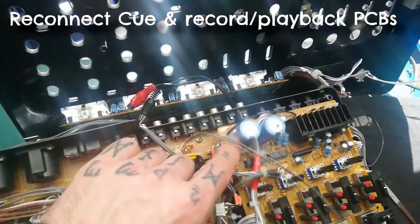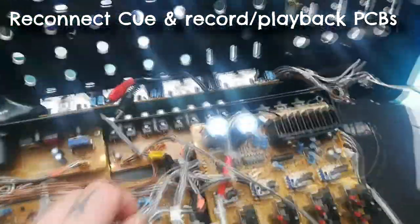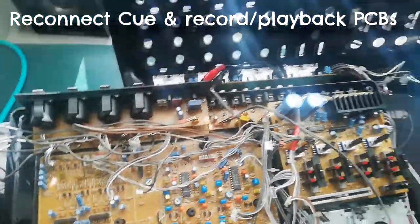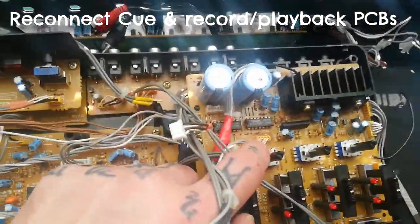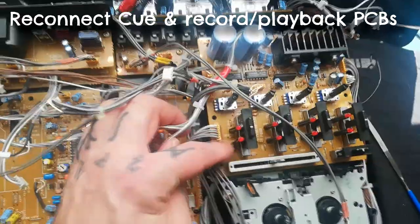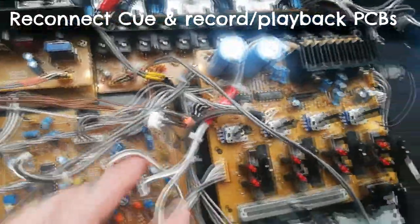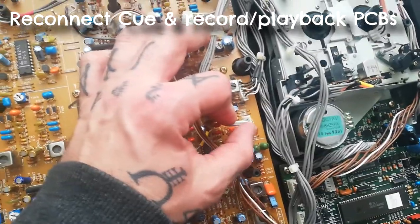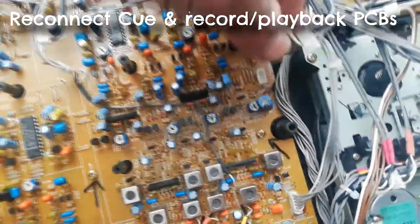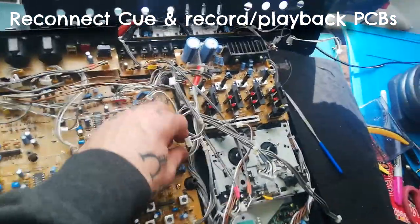I've got a little short one coming from underneath this cap here to this header under this mounting post. So that's JA01 and JA02 respectively. This one starts here, JA05, going to JA06. This one immediately to the left of these record arm switches, JC01, terminating in JC02. JA01 here is joining onto J802. That's there. So from there to there.